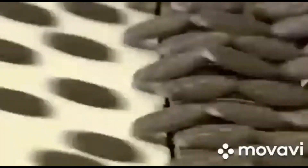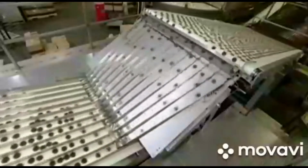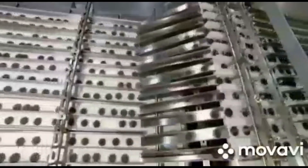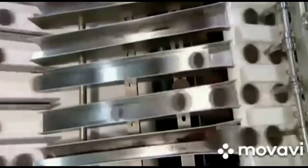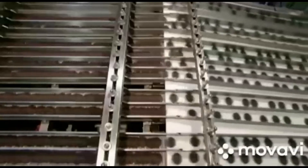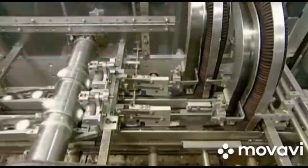The chocolate wafers then move to another conveyor which feeds into a series of chutes. The wafers travel over ramps designed to make them fall into a standing position — one wafer lands inside up and the next with the embossed side up — correctly orienting them to be sandwiched around a cream filling.